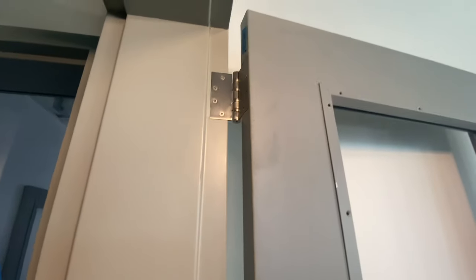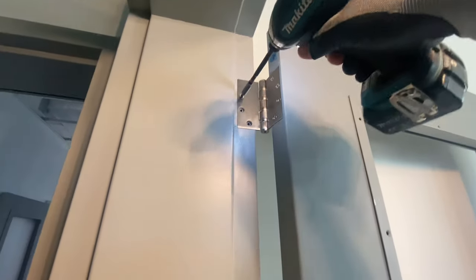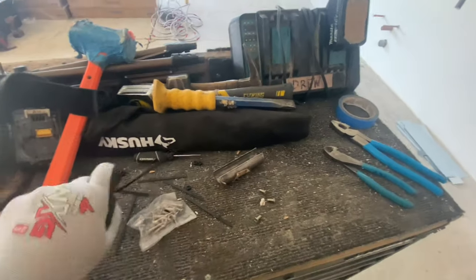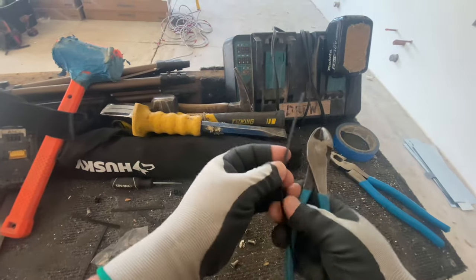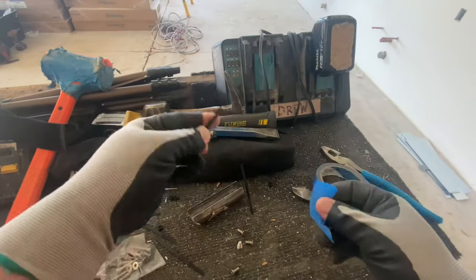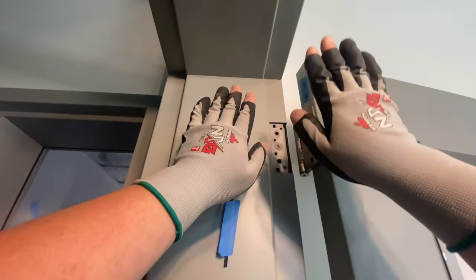To do that, we're going to shim this top hinge back. There are many different ways to shim and I'm just going to show you one method today. To start off, I'm going to loosen this top hinge from the frame — these are stainless steel screws. Give it a little whack, pop it out of the pocket, and now I need to shim it. The method I'm using today is a zip tie — a thin piece of plastic, probably about a 1/16 inch thick. Now for fire-rated doors, you need to use metal shims. This is a non-rated frame with a non-rated door on a non-rated wall.